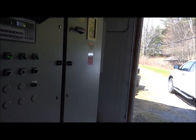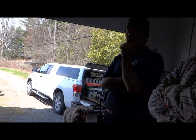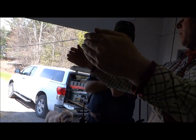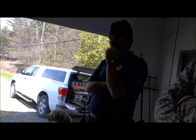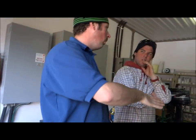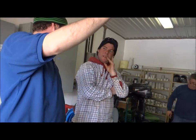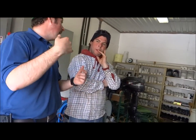I'm going to close the block. That makes it easy too - when you've got that block filled, you open from the next block. So you open the block, fill it, close it off, fill the next block. We've got all the water on the drain - like on hole 17, you've got a lot of water up there that's going to drain back down. So you open it block by block, fill it, close it down, then go back and open the valve.